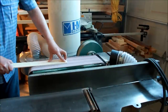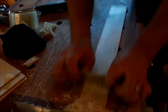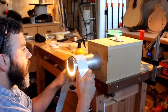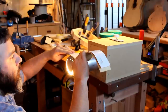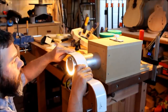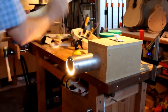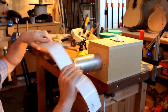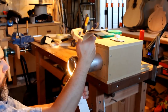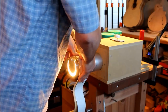I cut up another piece of that 2x4 and put it to the proper width, and now I'm working on thicknessing them to a thickness I can actually bend without cracking. This device here is something I made myself — basically a 200-watt light bulb inside a four-inch aluminum pipe, with a dimmer to adjust the heat. When it gets too hot you just dial it back a bit, and then with water and the backing strip I get the shape I need for the sides.